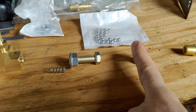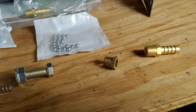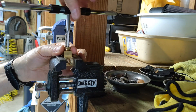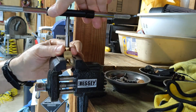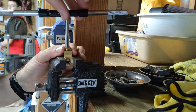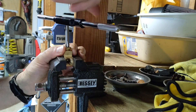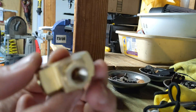I've already cut off the side of the adapter, and now we're going to tap it. For stability, I'll put the MPT adapter into the T-fitting, put it in the vise, and start tapping. If you've never tapped anything before, you screw it in about a half turn and then go backwards a quarter turn, relieving the shavings, until it's threaded all the way through. This fitting is made of brass, which is a soft metal, so it's very easy to cut through with no cutting thread oil.